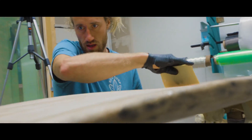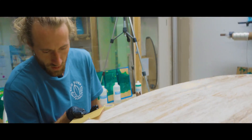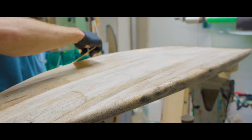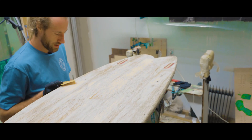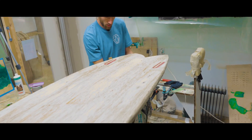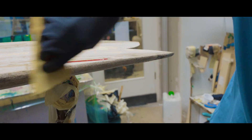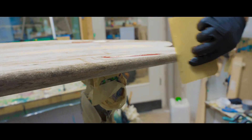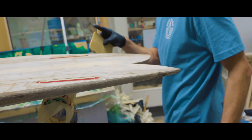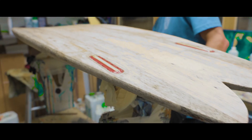So we have no shiny parts. Normally you would remove all the epoxy which is laying on there. You can look from the side if there are any shiny parts or little epoxy legs - just get them away, you don't want too much. Here on the rail we can also push the epoxy in again with the squeegee, just go over that a few times. Nice - all the epoxy is in the grain.